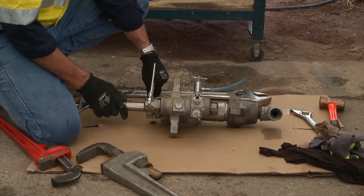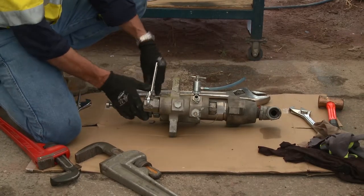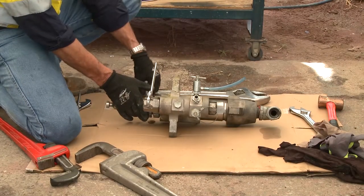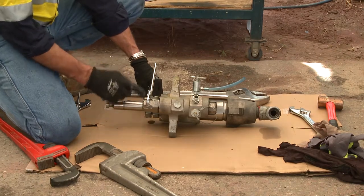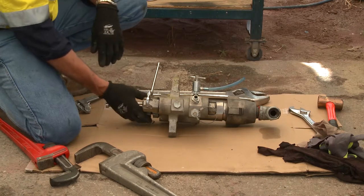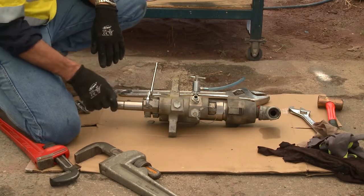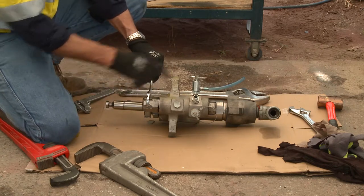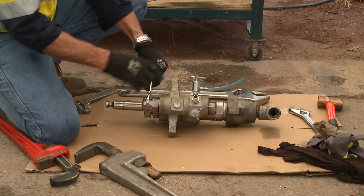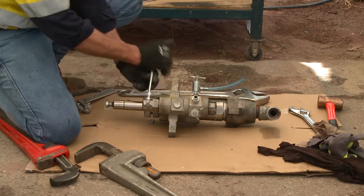You'll find the castellated nut could be tight. If it is, you'll need to put a piece of tube on this to assist in creating a better fulcrum to undo it. We loosen the castellated nut primarily to take the torque and the pinch off that piston. Now that we've done that, I also suggest you undo this particular filter housing before you dismantle too much.